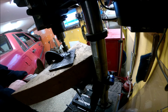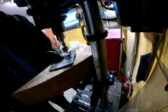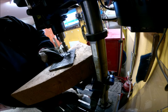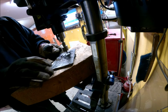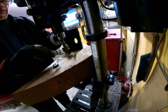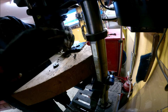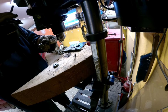Okay, so what I noticed on these cutters, that's my cheap drill press. It's too weak, because these cuts, they're really aggressive. So what happens is that first I ran it on 580 RPM, which is the lowest this drill press can handle.